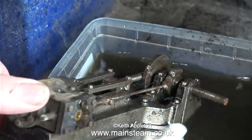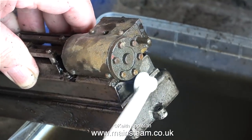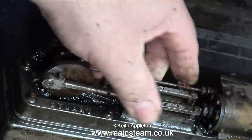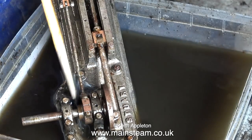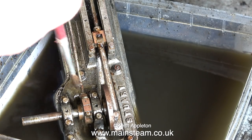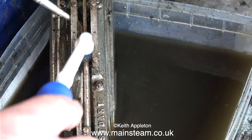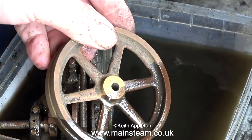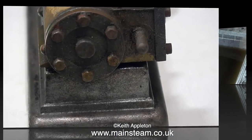I've speeded up the video because it's a very slow, tedious job. The electric toothbrush won't fit in every area of the engine, so for more inaccessible areas I'm using a long thin stiff paintbrush followed by a smaller paintbrush. Many people have warned me about putting my fingers in cellulose thinners, and really I should wear rubber gloves — but I don't like wearing gloves in the workshop. By using the electric toothbrush and the other brushes, I don't have to put my fingers in there anymore.